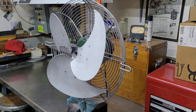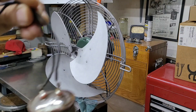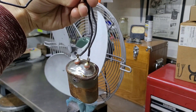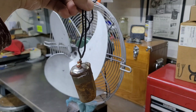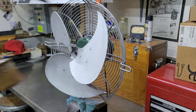The fan was seized up, and the capacitor — I could see on the back — it was kind of bulged looking. I actually have the capacitor here. Get a look at that. It definitely has some pressure in there. I really don't even want to be holding it right now, because I keep thinking, what if it just suddenly ruptures? I'm not going to have a good day. But either way, that is the lovely old original capacitor.